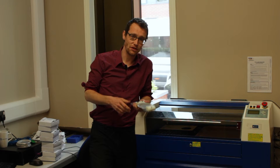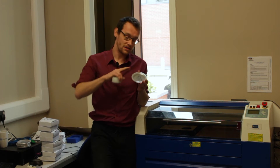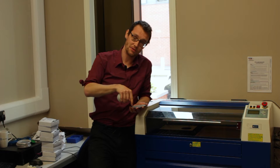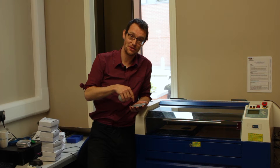There's a little bit too much flex in that. It also took a little bit of time to get it squared up, but the plates are such low quality that there's actually a bow — they're slightly convex in nature. So when the machine tool is engraving, it engraves the centre but not the edges. You reset the Z height to engrave the edges and it drills through the centre. So it's been a lose-lose situation.